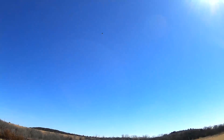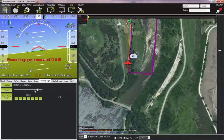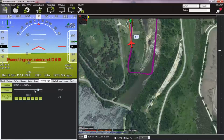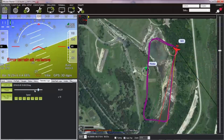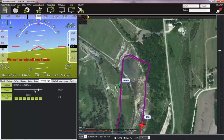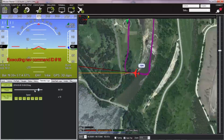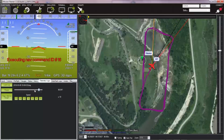First thing I did was to just trim the aircraft in manual mode, then I went to fly-by-wire mode and everything looked okay — did a few big circles and it looked fine. So I then went into auto mode. This is the last part of the flight shown here when everything had been tuned already. You can see it's flying pretty straight on the lines along a rectangular course, and once it intercepts the line following the turns it stays right on it — it succeeded pretty well.